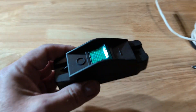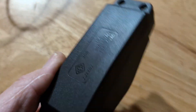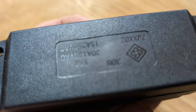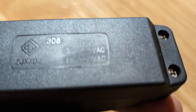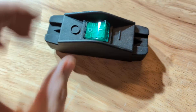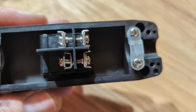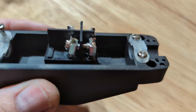The switch I'm going to use is this one right here — this is a 120-volt switch. I'll put the link in the description below, but make sure you get a 120-volt switch, not a 12-volt switch. This one is rated at 30 amps, 125 volts. It actually has two connections here so you could put two wires through, but I'm just going to be putting one.